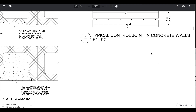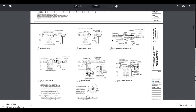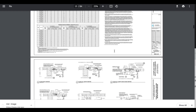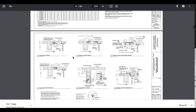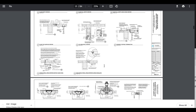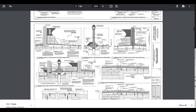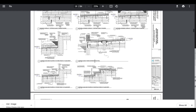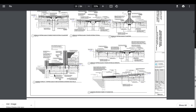I do not want you to think that's the final word, because this engineer did these drawings — he's the one that determines exactly the intent of what it looks like and what it's supposed to be. That's about the detail for that area, but I want to show you how you can do exterior reinforcement. That was just two pieces dry-fit, no epoxy. Epoxy would help make it a lot more stable system, including filling the void and locking it in place. There's a better detail of it.